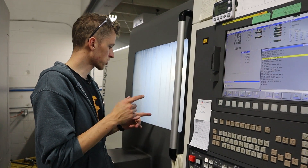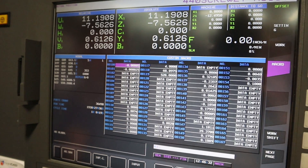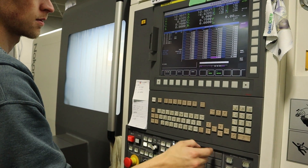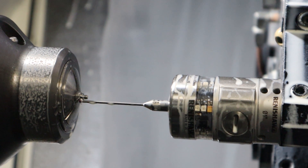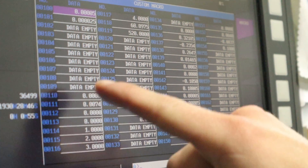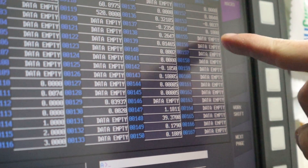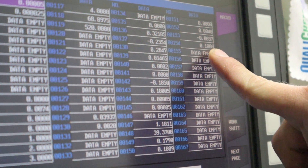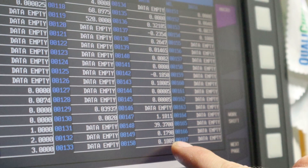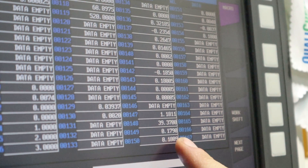Right now we're just going to turn a diameter. That part was just measured at a diameter of 1.8005, which is perfect — the goal is 1.800, so the part is absolutely perfect. Down here in 149 and 150 you have my range, my min and my max, so as long as the measured size is within the range we're good, otherwise it'll spit it out.